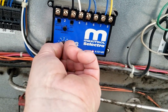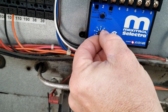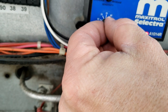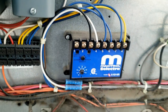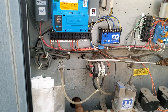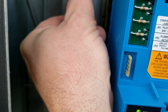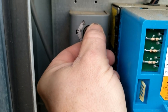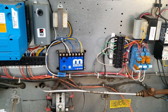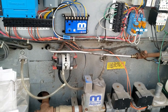This is for a kitchen, so I really don't think we need it quite that hot. They'd probably prefer somewhere around 65 degrees at most — we basically just don't want to add a lot of heat to the kitchen, just want to neutralize the incoming air. Around 55 to 60 degrees is probably fine depending on what kind of people you've got working down there.